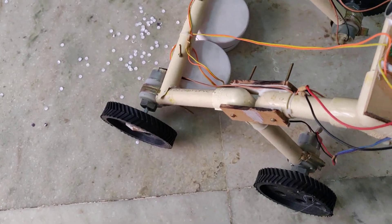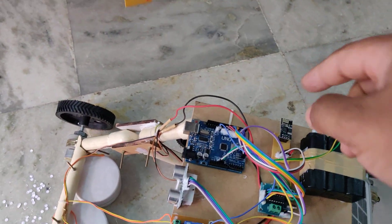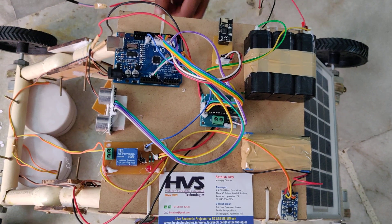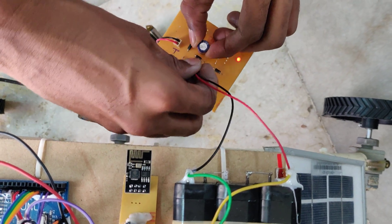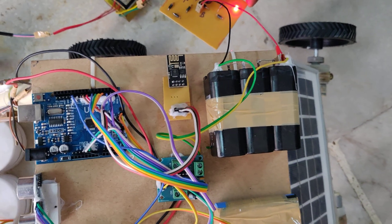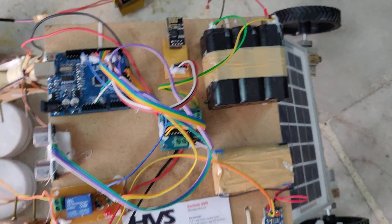To recharge the 12-volt 1-amp battery, we use this charger. Connect the transformer to the mains socket, then connect the battery at the B-end. Once you switch on the power supply to the transformer, there is a light indication on the charger. The battery is now charging and it will take a maximum of eight to ten hours to fully charge. After that, disconnect the battery from the charger and switch off the charger.